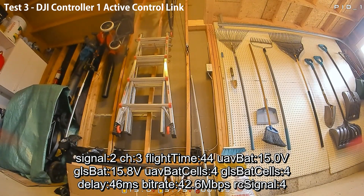We're seeing our bitrate coming down — still pretty strong, but we're down to the 20s, and now I'm seeing 17, so it's starting to come down pretty quickly. Our RC signal is at 3, holding pretty strong, and the props are spinning, so things are looking good. What I think is going to happen is we're going to start getting choppy, blocky video way before we get a loss of RC signal or failsafe, and that would be our indication to turn around — bad things are about to happen, but very predictable so far.